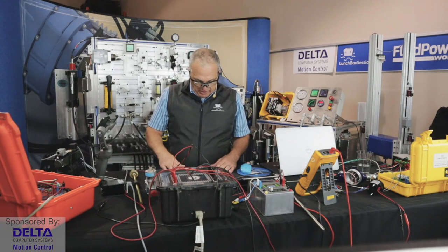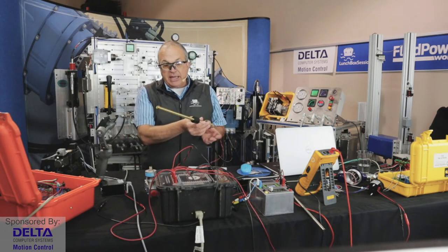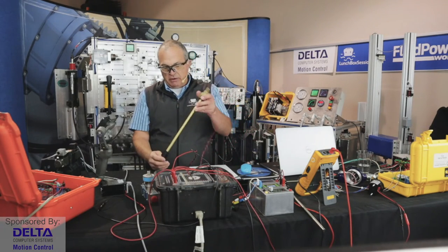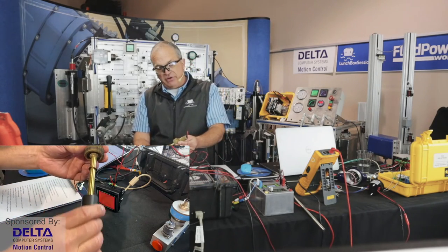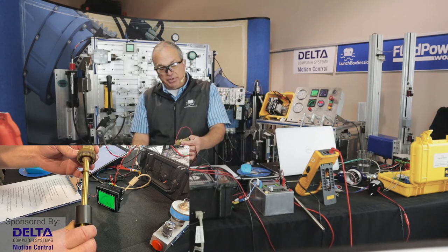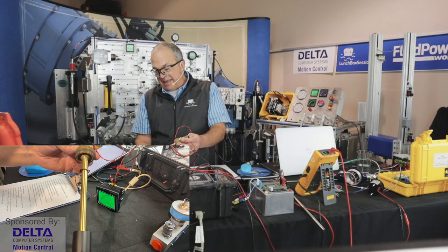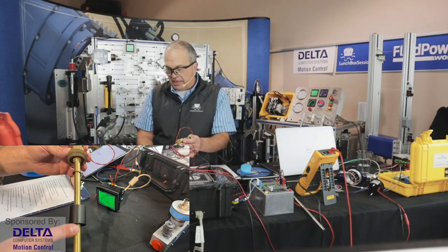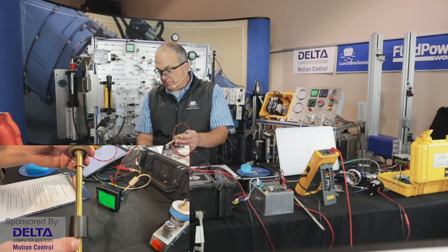Super. All right, so we've covered off on temperature. Let's have a look at another very popular electronic and electrical application in the world of hydraulics, and that is to measure the level of fluid in the tank. And so you'll often find that some type of instrument has been attached to a port at the very top of the hydraulic tank, and then perhaps there is a float that runs up and down with the level of the fluid to help. I mean, in some cases it's just a level switch, but I like to have data served to me more accurately.